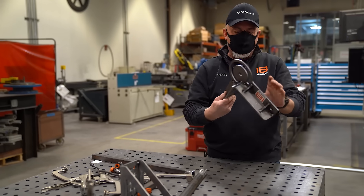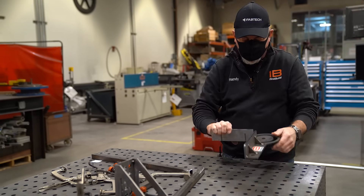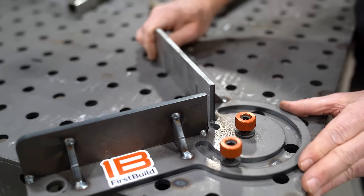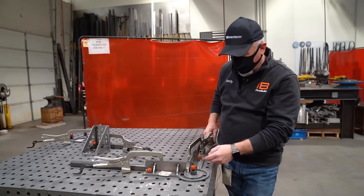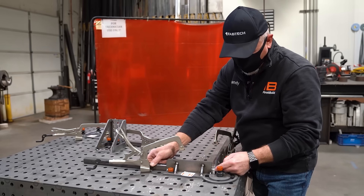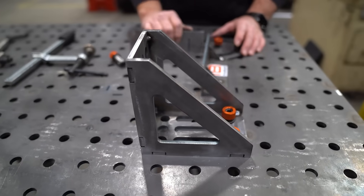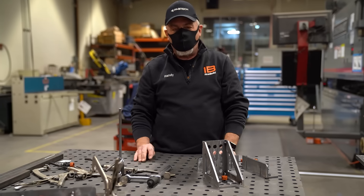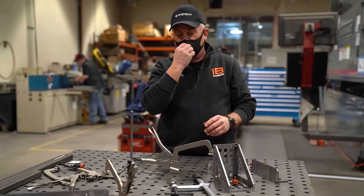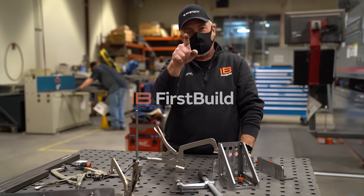We designed another fixture based on some of the work that we do here. This is a right angle, but it can be a right angle at just about any angle — we can drop one of our pins in and rotate this back and forth to get whatever angle, infinitely variable from zero to 180 degrees. We've got the corner cut out so that we can actually join pieces at 45-degree angles and run our bead down through the joint in the corner. The table is very powerful not only as a flat surface but in the fixturing as well. We are on a journey to completely fabricate our own table with all the fixturing on it, and you're following along — see you on the next video.